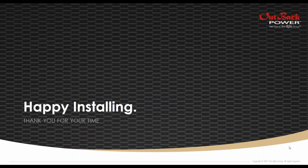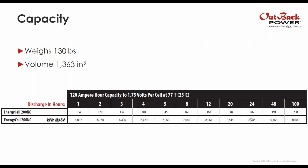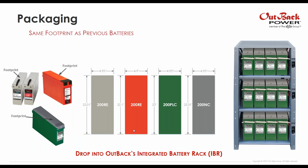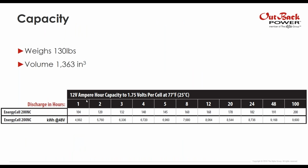All right, so it looks like some questions about energy density. I think I provided that information, in case you needed to look at that. It was watt hours per kilogram, watt hours per liter, etc. Let's see if we have that in kilograms. Oh yeah, we do. On the spec sheet, it's 59 kilograms. You have your amp hours, and to get watt hours, you just multiply by your voltage. Then you can use those units to get those densities. See, I knew that was a popular question.